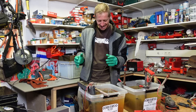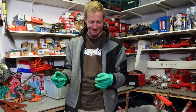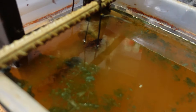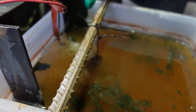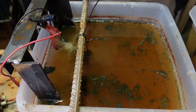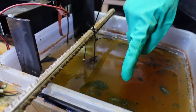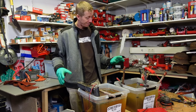And now I can finally say it's working. All this time this one was working the other way around - the polarity was reversed. If you go to the box now you will see a big difference. First of all, you don't see a lot of bubbles at the bare metal anode spot anymore - that has changed. All the bubbles are now focused around the material we want to clean. Also a bit on the clip - we were worried about that, but the reason is we had a reverse electrolysis on it before, so the clip got dirty. The bubbles on the clip now are simply the clip being cleaned. Finally both setups are working.